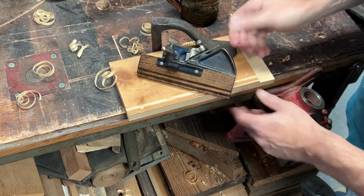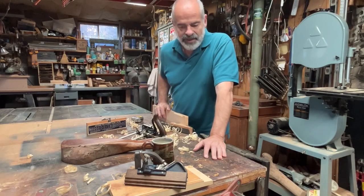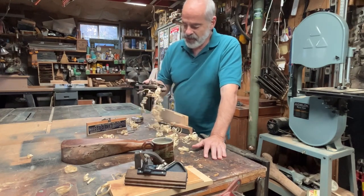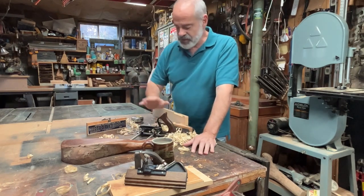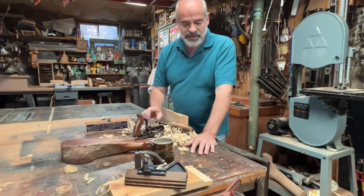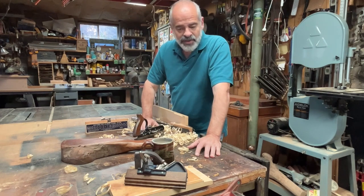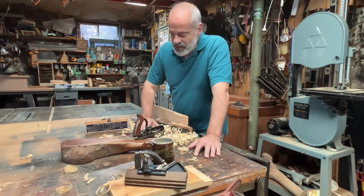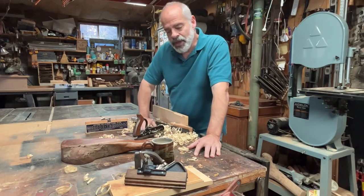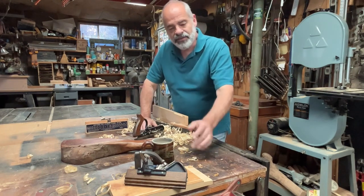So there you have it — a nice little comparison. The 50 is also a good plane. There are older and newer versions of it. It certainly has more cutters, and I'm not suggesting you should buy that instead of this. I'm just suggesting that this 040 will do the quarter inch, three-sixteenths, and one-sixteenth — the smaller grooves in your smaller projects — very easily and nicely. It's a fun little plane to operate, so I wouldn't discount it if you have a small shop and don't need all the different extra cutters.